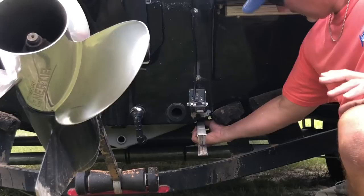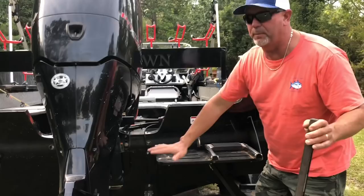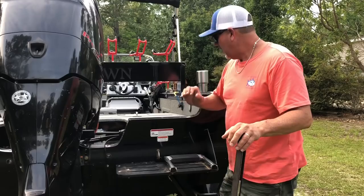When this boat is sitting in the water, the waterline comes up in here so the transducer is up in the water good. But the reason I did not mount it below flush is so that when I get on plane, it's not catching water and shooting a rooster tail up in the air — I did not want that.